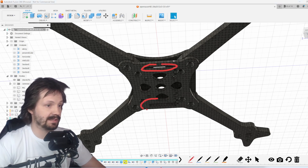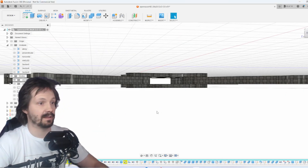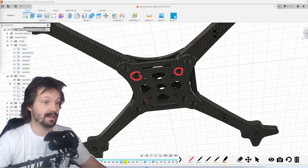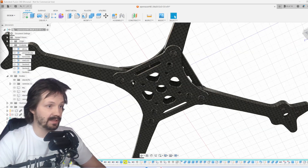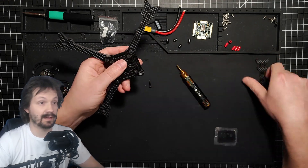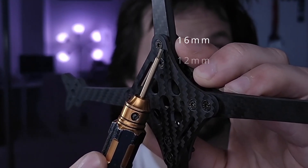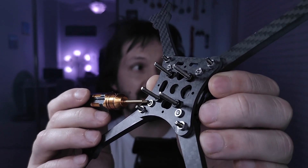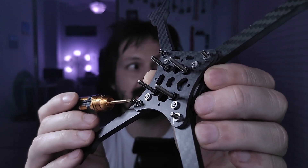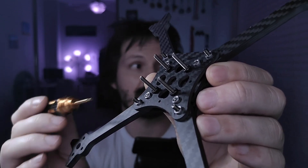Now the bottom plate. These little slots on the sides are for your battery strap, and there's plenty of room so it's not rubbing ESC or electronics like in other frames. Next, these four internal construction screws must be 12 millimeters and they are countersunk. When you put them in, they must go through the press nuts at the top. Put them in and insert the arms, then secure the arms with the outer screws. These outer screws should be 16 millimeters — so 12 millimeters for the inner and 16 millimeters for the outer. The 12mm screws should be flush with the press nut, and the 16mm ones are sticking out but not too much — if they stick out too much you'll have problems securing the canopy; if not enough, the standoffs won't be secure. And don't blindly assume you're always getting correct screws from the shop — everyone makes mistakes. So tighten them up and you're good. This was the whole carbon frame assembly, just 12 screws.